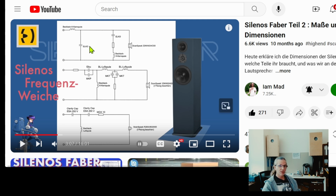Of course, why is there an electrolytic capacitor? Because you need a high value capacitor there, and electrolytics are cheap and small, and a high value film capacitor can cost you a whole lot of money. Now that's why you need to watch my channel, because I can recommend affordable high value film capacitors. These are called DC link capacitors, DC link film technology, and DC link capacitors nowadays are pretty affordable, very affordable.